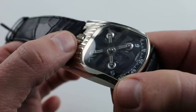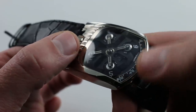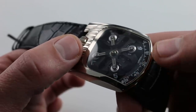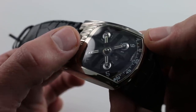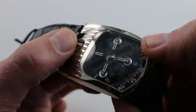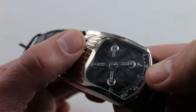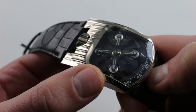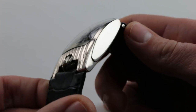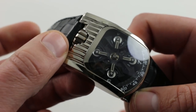A Maltese Cross system is used, in contrast to the index wheels and springs that Audemars Piguet used when it first attempted this time display system in the early 1990s. The Urwerk system of Maltese Crosses is better suited to a wristwatch than AP's old system, which was perhaps better suited to pocket watch applications — this is more robust and befits a watch designed for everyday use. You'll notice how the Maltese Cross ensures the rotating of the outgoing hour as well as the rotating into position of the incoming hour; it's simply a digital display read in a linear fashion. The movement really is central to the aesthetic of the watch, but the white gold case is beautifully finished — all high polish on both its flanks and its tops, with a little step to break up the shear of the case, as well as a striation that blends into the knurled finish of the crown at the head of the watch.